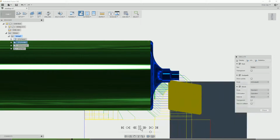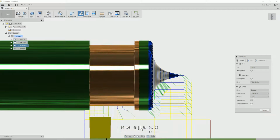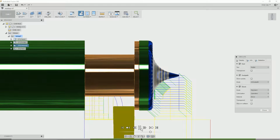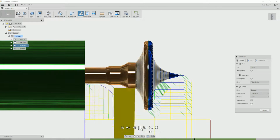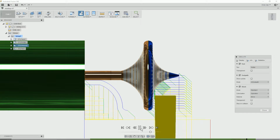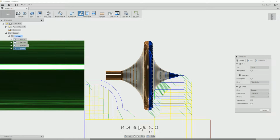Seen most of this before. The only new bit will be the cut off. So that's the profiling for the front end, grooving for the back side. Notice the grooving now goes a little bit further back because we're 3mm extra we specified, so our cut off is going to be a little bit easier. The top shape, and finally finish at the front edge, and now cut off. And there's our top. So that's the top machining completed.